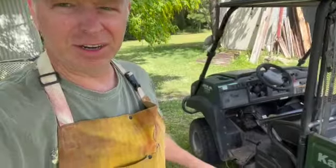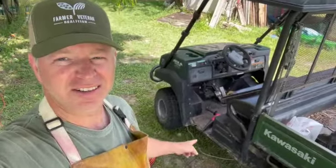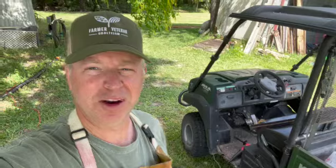What I got to do now is finish shaping a little bit of the stuff that's going to go down in here. Hey, there it is. You can see I still got that wire hanging down there. Not too crazy about that. But I got to finish shaping that a little bit so that the replacement pipe will go on there. And then I'll grind down the areas around it so I can get a good weld to make good contact with the metal, and then weld it and see how I did. So that's what I'm doing.